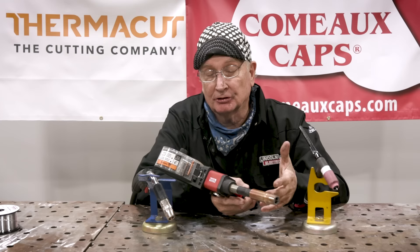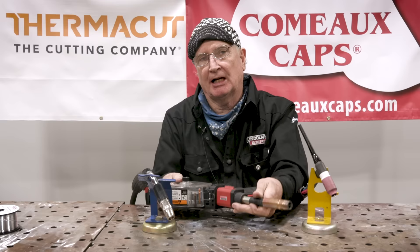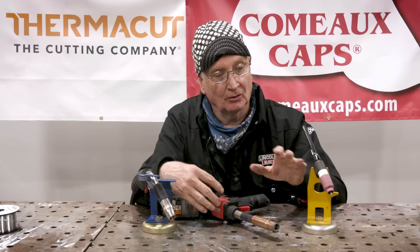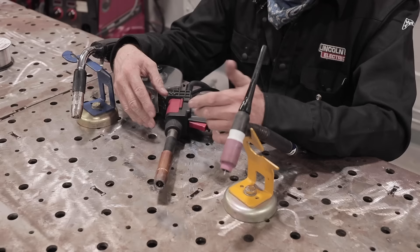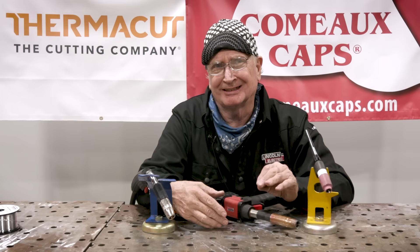Some disadvantages: it's big and bulky, but you get used to it — it becomes second nature, and having a grip on it means you can hold the nozzle and get very precise. It's not going to give you the stack of dimes like a TIG will, but achieving that with TIG takes a lot of practice. If you really want a stack of dimes, you can lay it down with a spool gun, come back with a TIG on top of it, and get that scalloped look.